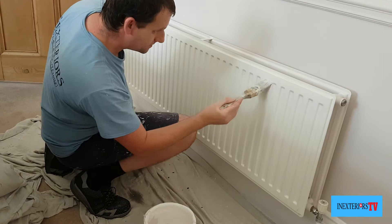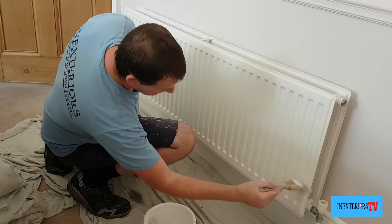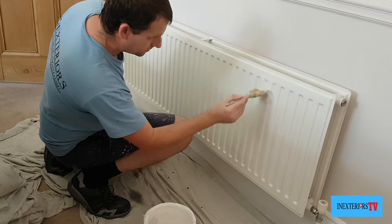Now we've painted all the backs and sides, it's time to paint the front. What I do is use my inch and a half brush and paint all the top bits in, then all the bottom bits in, then fill in the middles. I do this a section at a time, making sure I work out the paint really well and lay it off up and down.